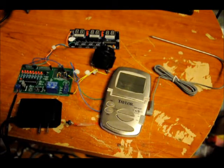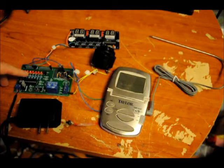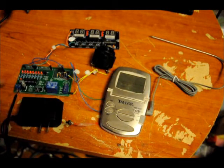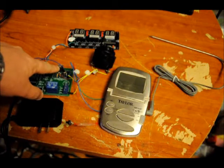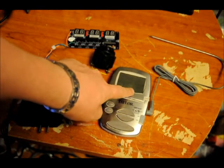Let me just explain the circuitry here. Here's one of my custom boards. Everything's controlled with a PIC18F1220. You've got 5 volts regulated on a 7805, which is transferred to the digital clock. And there's an LM317 circuit regulating the voltage down to 3.12 volts, which powers the thermometer.